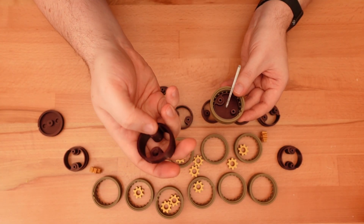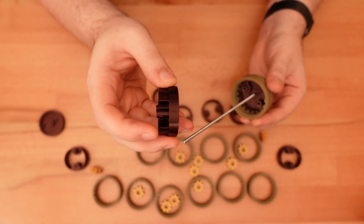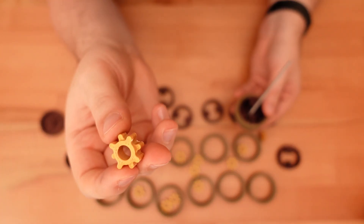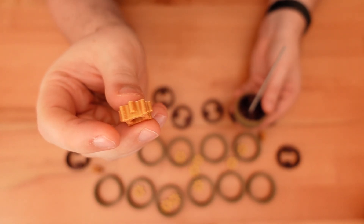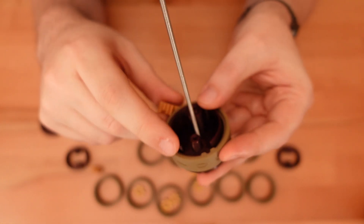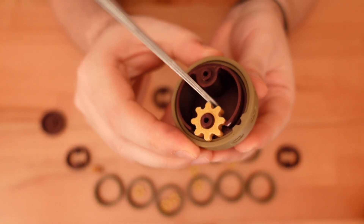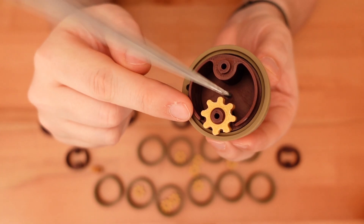Next, add the core. These two spots on the bottom should line up with two pegs on the previous layer. Make sure you line it up so that the portion of the wall that's open — this part right here — lines up with the portion of the wall that's open in the previous layer. Like that. Next, add the indexing gear. One side of the gear is completely flat, but the other side has teeth at different elevations. This side is going to be face-down and it connects on this little peg. When you place the gear on, it needs to be rotated so that it falls into the correct spot. You'll know it's correct if you can rotate the outer gear and have it advance as expected.